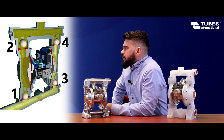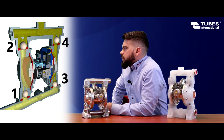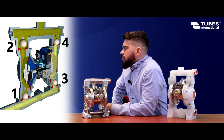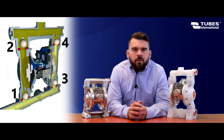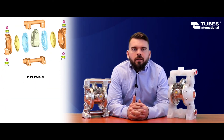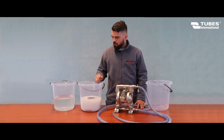There is a special valve installed in the pump which uses a pressure compensation mechanism. No matter what position the pump stops in, it will move back to the correct position once the pump is restarted. The material the diaphragm pumps are made of depends on their application — it can be either EPDM rubber, NBR rubber, or PTFE.